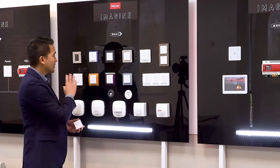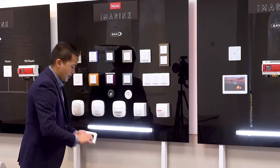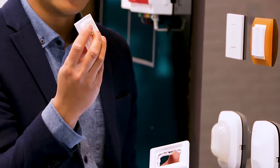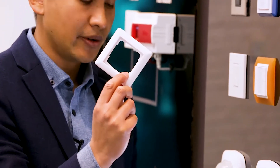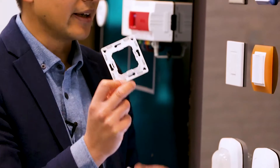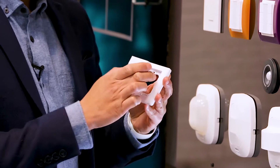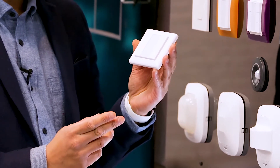It's a modular design like the 1.3 panels, but in a slightly different way. The assembly is a straightforward three-piece design. You have the button module with buttons at the front and DALI 2 connections at the back. Then you have a separate frame — a straightforward white frame supplied in the box — and a single gang grid which the module attaches onto. The grid and button module simply click together and hold the frame in place.